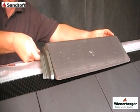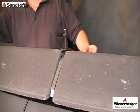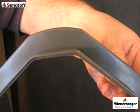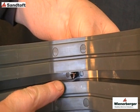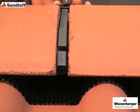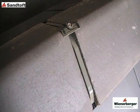A Multiversal union is positioned between each ridge. A screw with a sealing washer and plate is located through the hole in the union and screwed into the ridge batten to secure the ridges. When using Multiversal with profile tiles, the unions incorporate a great feature which grips the screw, pulling the union up into position when located over the tile pans. And there we have the installed Multiversal ridge and hip system.